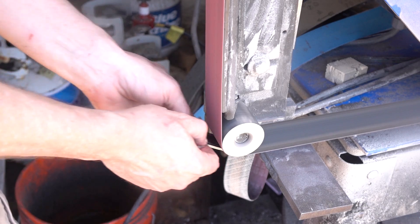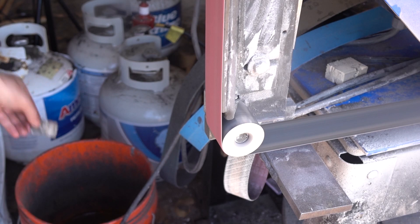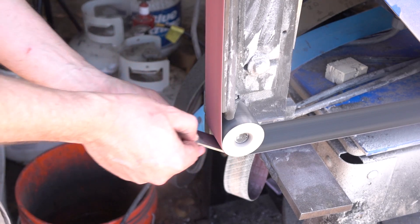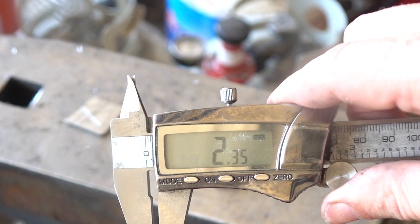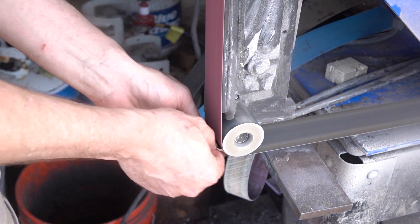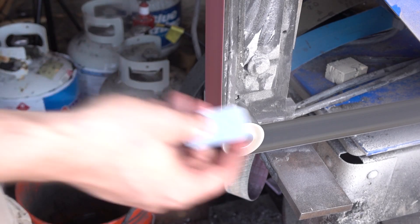These bars made up about two-thirds of the iron used in that project, while some flattened but slightly thicker wrought iron hooks made up the rest. They come up to just about 2.35 millimeters thick after they're ground flat. I never really measured the flattened iron hooks, but I estimate they're around 4 millimeters thick — somewhere in that neighborhood.